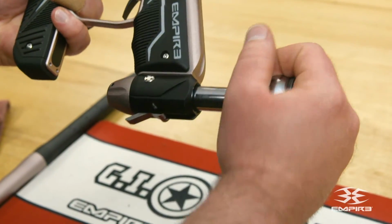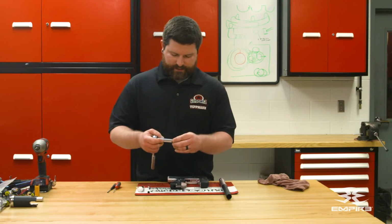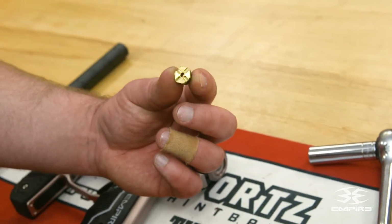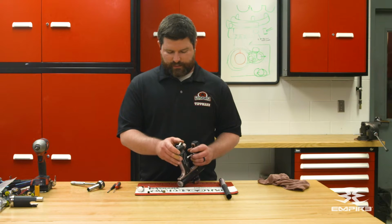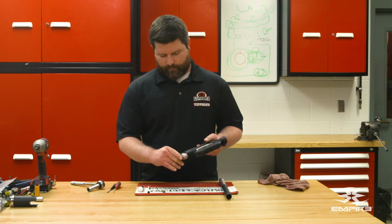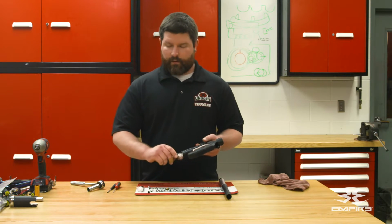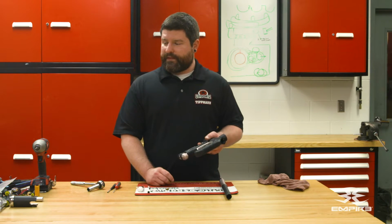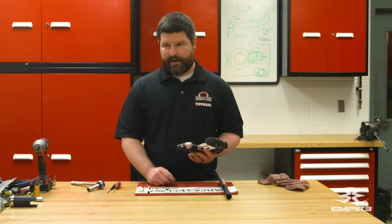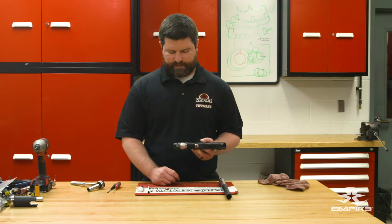One thing that I'll mention about this whole system is that this brass nut, if it's over tightened, it'll cause you some issues with your on-off lever. What can happen is if this is super tight, you'll go to flip your lever into the off position and you won't get any venting. That's because that wedge pin inside there is getting bound up by that brass core inside there.